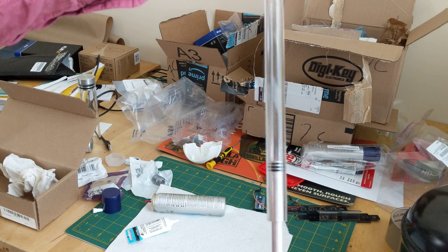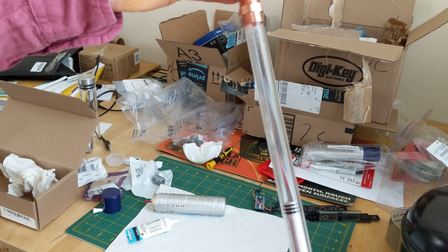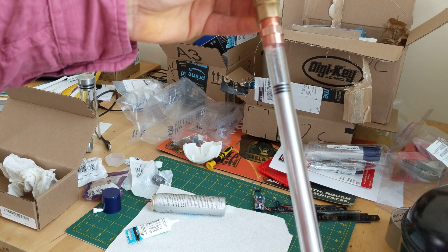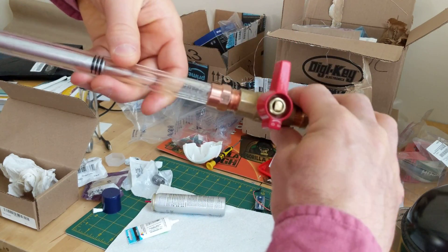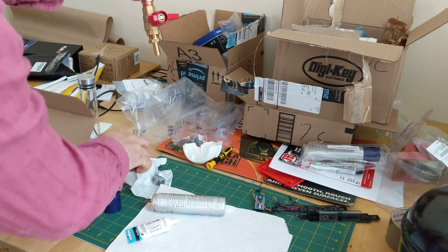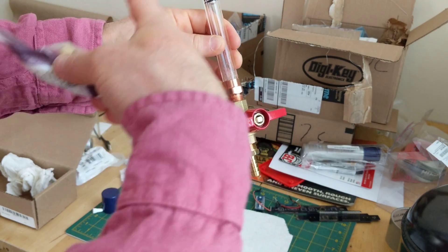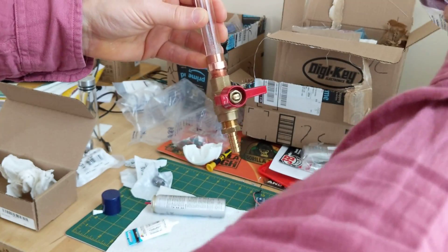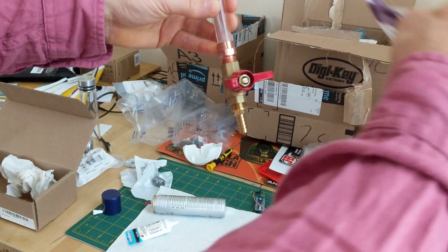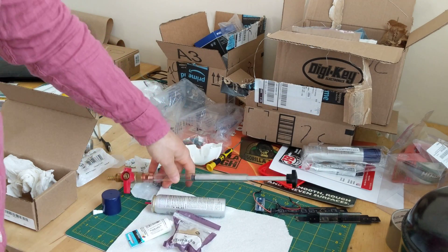But for now, this is the simplest air conditioner I think you can make using hardware store and Amazon parts. Hopefully we can get that seal better and really get it working. Next step is going to be to connect a T to here, and then more valves. That way we can have a condenser and an evaporator — compress it into a condenser, and then run it through an expansion valve into an evaporator, and get actually a hot side and a cold side. So maybe that'll be the next video. Thanks.